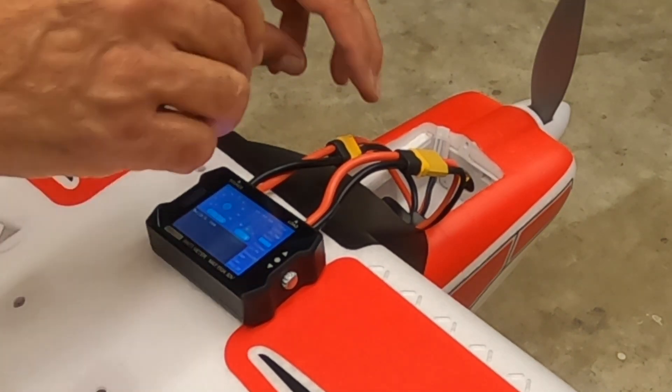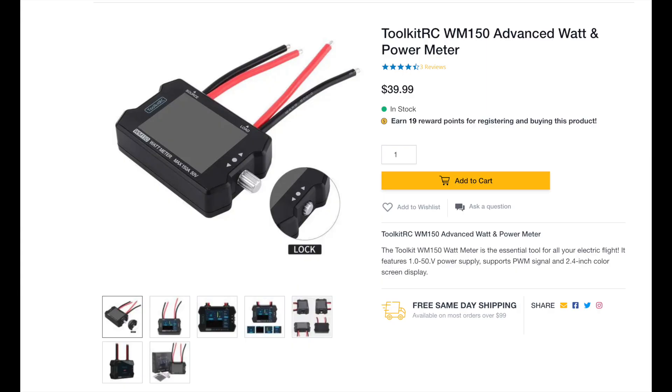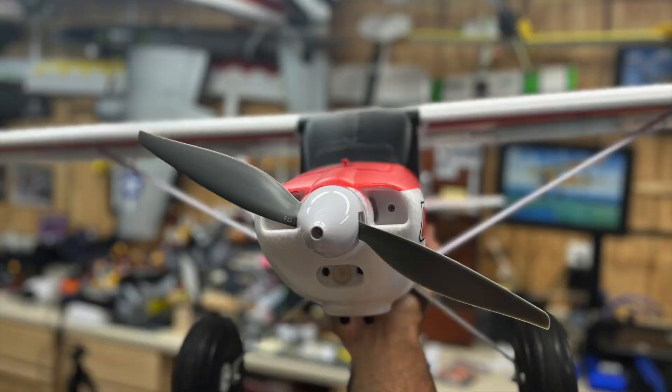Confirmed: 28.7 amps and 346 watts. This watt meter is something I use all the time as I'm reviewing planes and looking to make a little more performance. Sometimes stock props are not ideal — they're not as efficient as a Master Air Screw or an APC. I use APCs a lot; they just seem to work better, more efficient, and a lot less expensive. If you're interested in that particular watt meter, I have a link in the description — it's with GetFPV. I've bought a lot of gear from those guys and they seem to be pretty solid. Anyway, have a great day, thanks for watching!